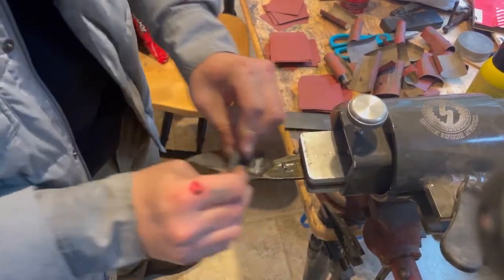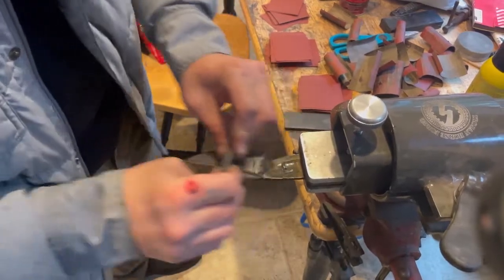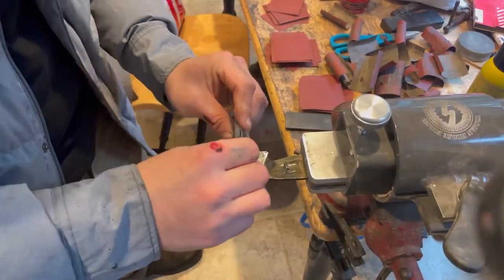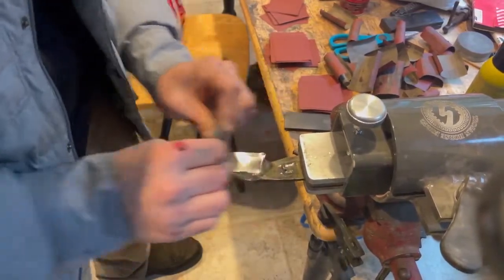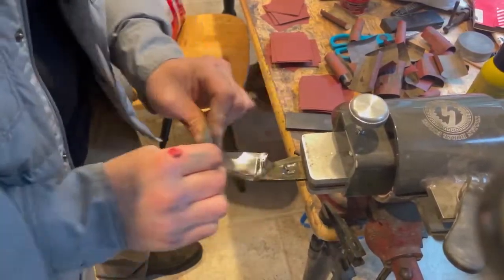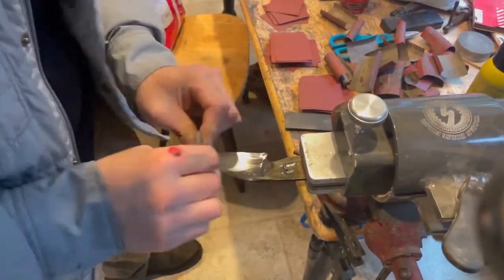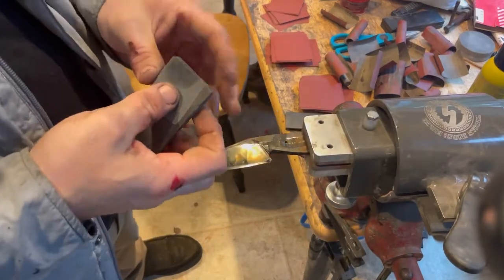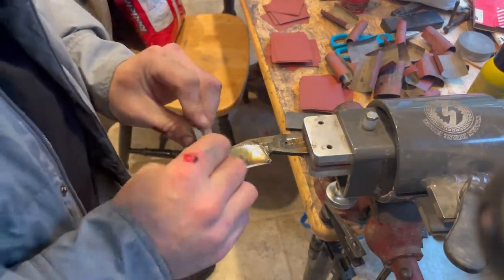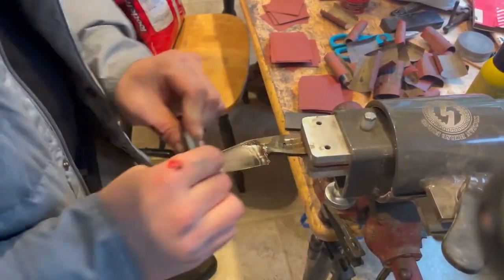So when I'm trying to do this sort of hamon, like a more grayish subdued hamon, I like doing that for more tactical type blades, which is why I'm doing it for the special operations Wu knife. So that's just my preference. But you're going to take the oxides off with 2500, ensuring that you got a really clean and even scratch pattern. You can make your scratch pattern very even.